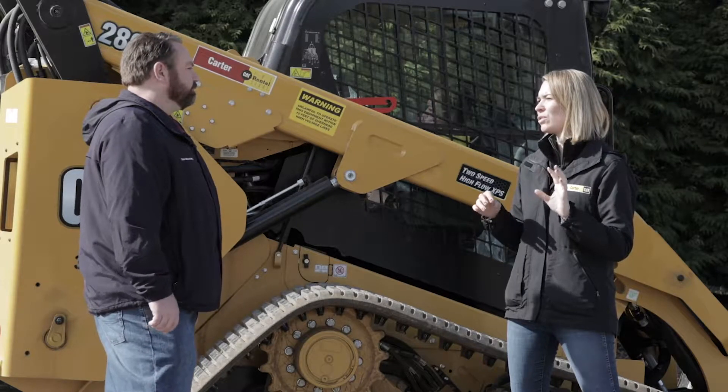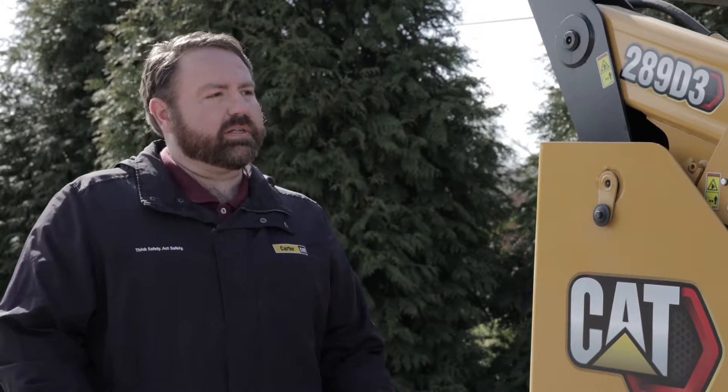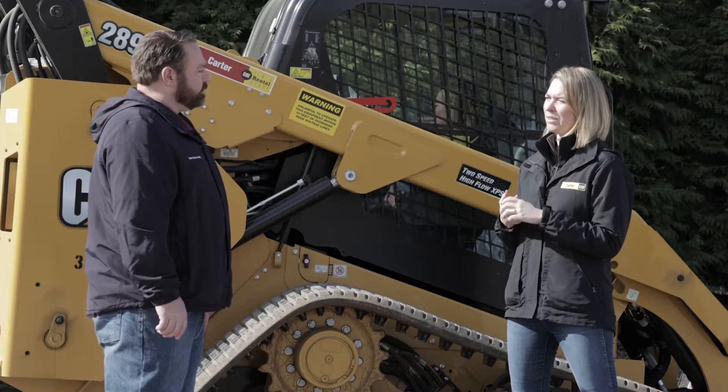Are there any things you should avoid doing? You need to make sure that you're trying to keep everything as clean as possible when you're pulling the sample. You want to make sure that your gun stays clean, and your tubing, and the bottle itself, and that you're wiping off the area before you pull the sample. Any extra contamination that gets in the bottle will definitely show up when we're doing the analysis. All right, I'm picking up what you're putting down.